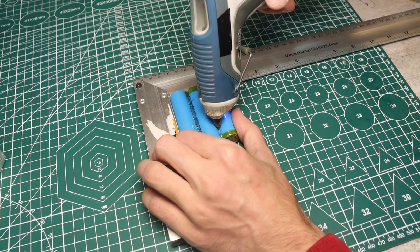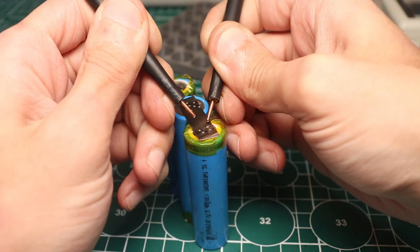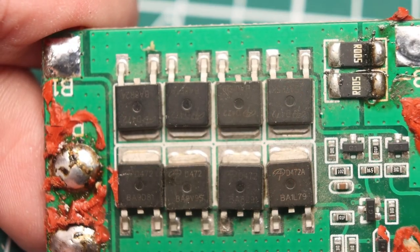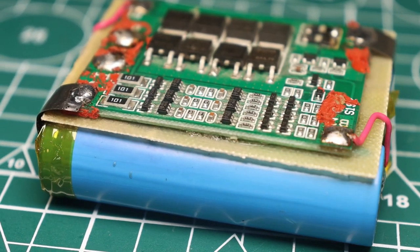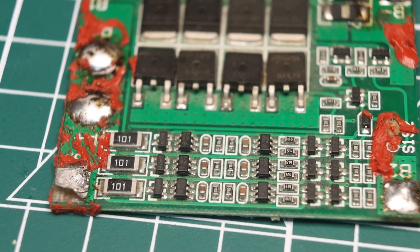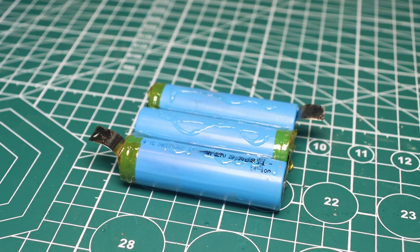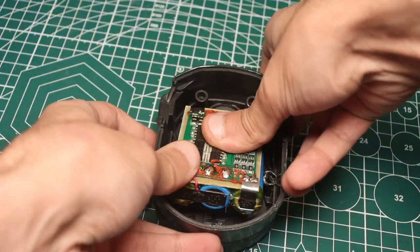I fixed them with ordinary hot glue and then welded the cells in series using nickel-plated tape with a thickness of 0.15mm. The battery protection board protects the battery from overcharging, deep discharge, and short circuits. The discharge current of this board is 25A. Importantly, in this design it doesn't go into protection when the tool is launched. This board also has a balancing system, which is very important — it's a classic kit for converting from nickel to lithium. Before installing the board, I glued a piece of thin fiberglass to avoid accidental short circuits, then installed everything in the original case and fixed it with B7000 glue.